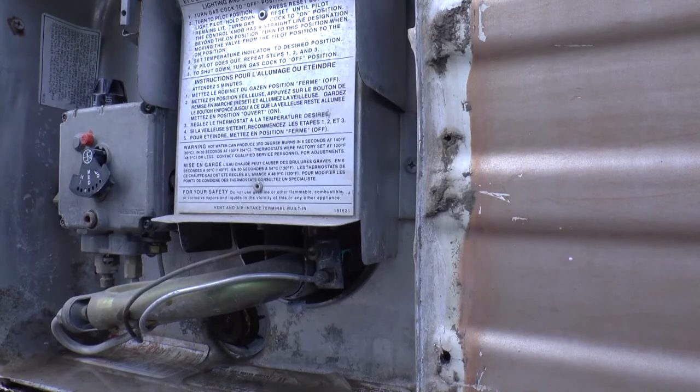And that's it. That was on an old 82 Ford Jamboree, but yours might be a little bit different — the principle is going to be the same. Here's a little tip for you if you're going out dry camping or boondocking where there's no water: go ahead and fill up your fresh water tank before you leave, then turn on your water pump and fill up your water heater, then re-top off your fresh water tank — that just gave you an extra six gallons of fresh water to take with you on your trip. My name is Jim with Full Moon Adventure Club. If this helped you out, please like, share, subscribe and all that good stuff. Until the next video, thanks so much for watching and happy camping.